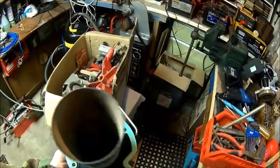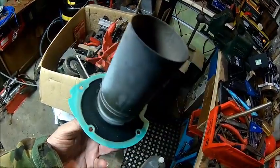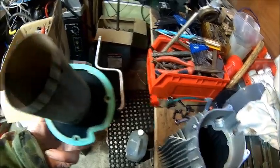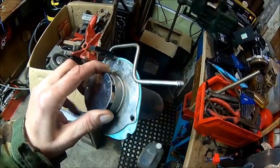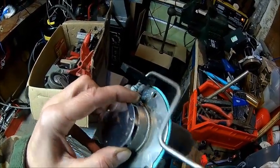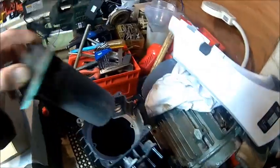From a burning point of view, if I look at the burner it looks like it's burning quite nicely actually. I think the black soot is only because it didn't start anymore — it was stinking and smoking. There's a little obstruction where the fuel comes in. The burner can't be dismantled — that's one piece. Even the fuel pipe is soldered in, so it's one piece, can't be dismantled. Simple design.